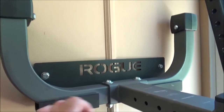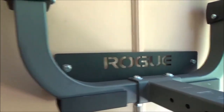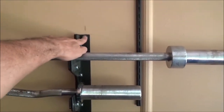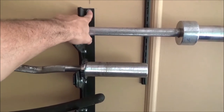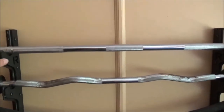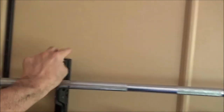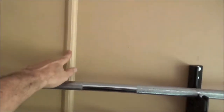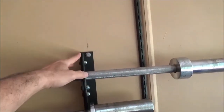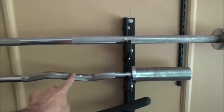All I had to do is buy some lag bolts, get out a level, find the studs, and put it into the wall. Same thing with mounting the gun rack — it did not come with the lag bolts, so I just had to go to Home Depot and get a lag bolt and some washers. I wanted to be able to put up my curl bar, so I mounted these backwards from the way you might. The reason is that from this bolt to this bolt you've got a stud in the middle, so it's 16 inches, 16 inches, 32 inches total. If I'd have mounted them the other way the rack would have been too narrow to hold my curl bar.